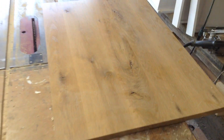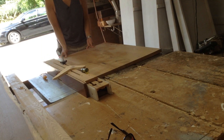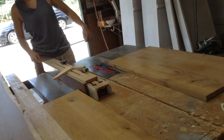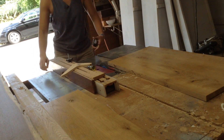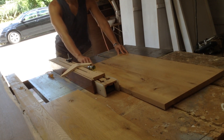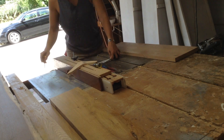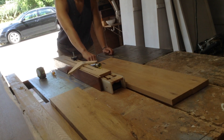The shelf material was an older piece of furniture the customer was getting rid of — some sort of oak tabletop — so I ripped it down to size. The depths of the shelves were based on what the customer wanted: the top one was about five inches, then about six and a quarter, and the bottom one was around eight inches deep. I ripped this into pieces and had enough left over to add the ledges on the backside. I also had to match the existing coating, which was just a water-based clear coat poly — pretty easy.